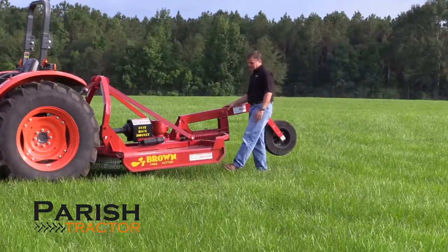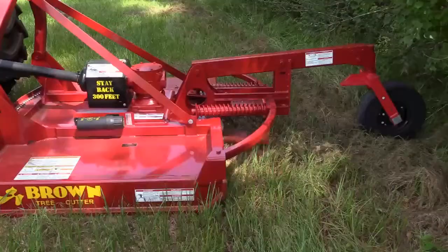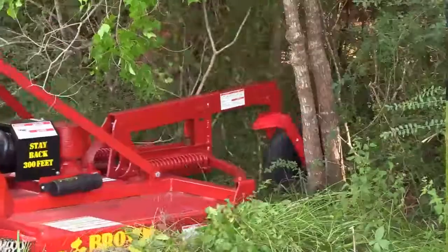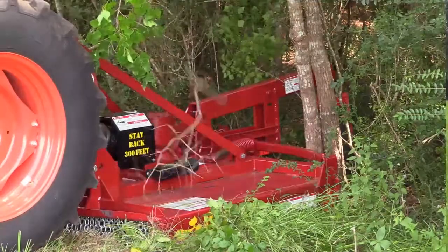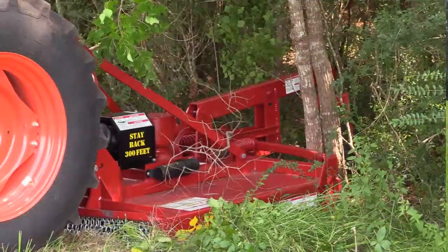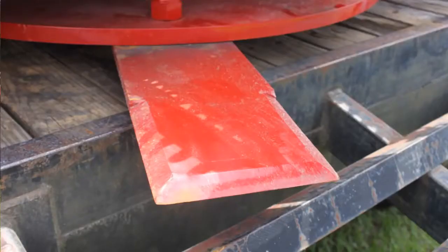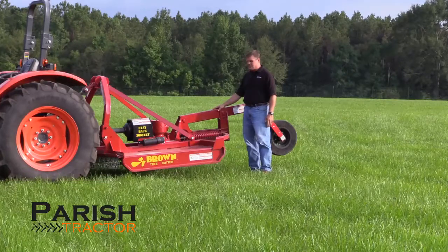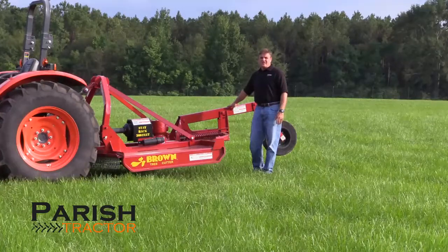What makes this one so unique is the blades protrude past the deck. These spring-loaded compressible bars — when you back up against a tree, the blade sticks out and strikes the tree. At 540 RPMs, you've got a one inch carrier plate with four blades on it. So do the math: at 810 RPMs, you're getting a blade hitting a tree 54 times a second, meaning a six, eight, or ten inch tree is going to get cut down really quick.